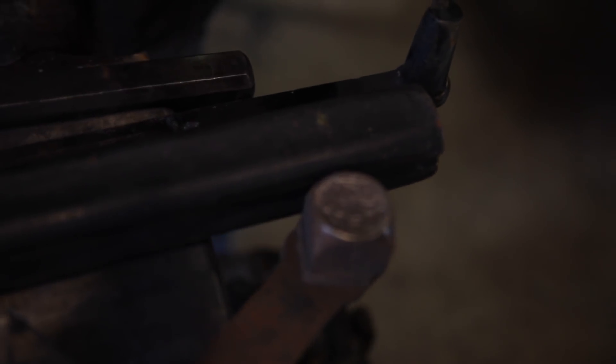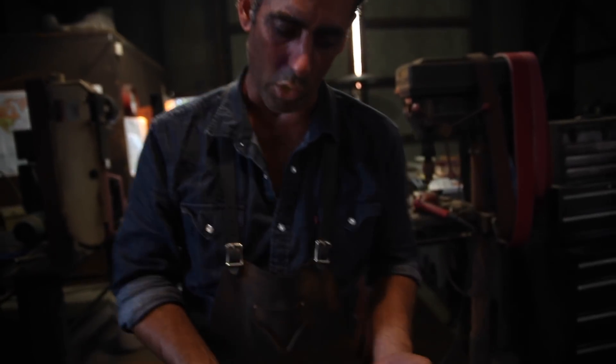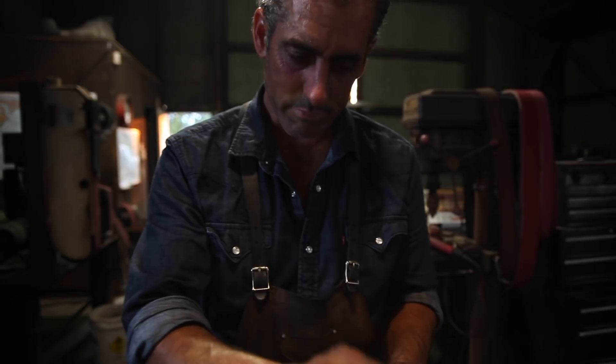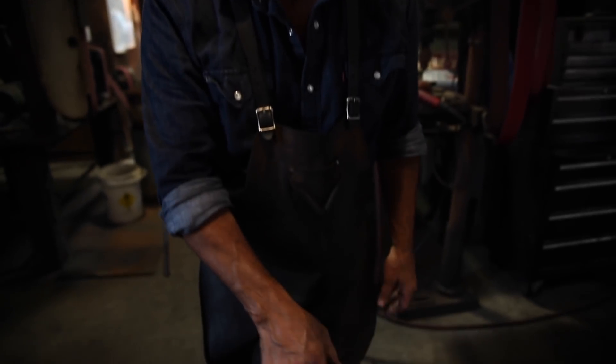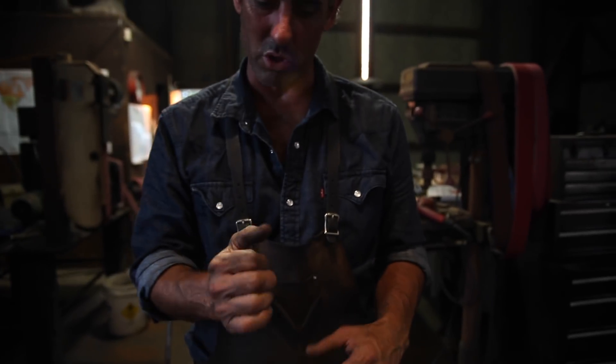Stamps — all of the stamps I've used the Atlantic 33. What's great about it is that since it's not as resistant as H13 or S7 when you forge it, it also files easier, or if you're using a die grinder or things like that. So when you go to make these specialty stamps, they're easier to make because you can put in the design easier with files, dremels, die grinders, chisels, whatever.